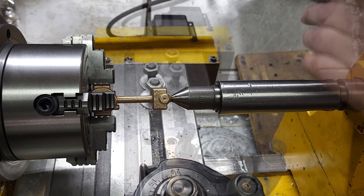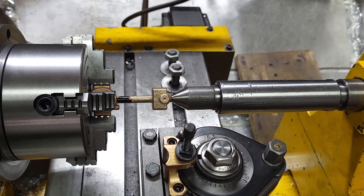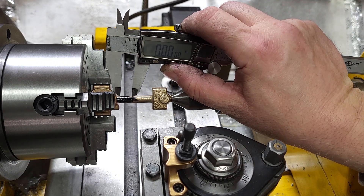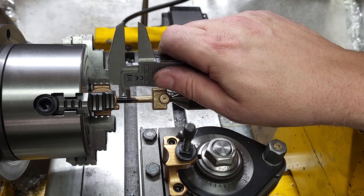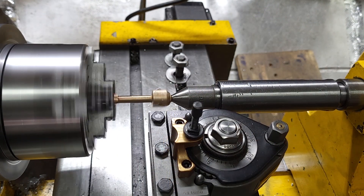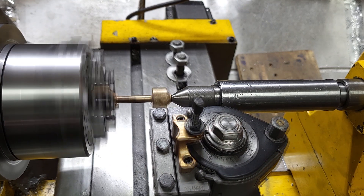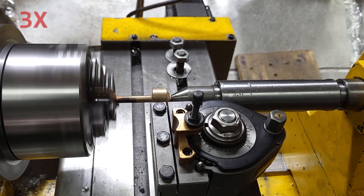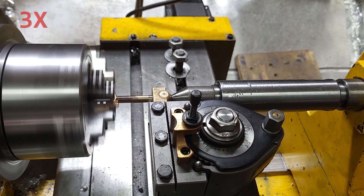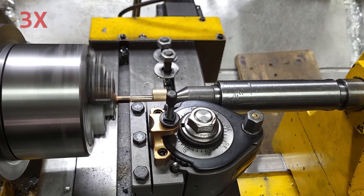A quick mark to mark the length I want to machine — three-eighths of an inch from the eccentric, because the eccentric needs three-eighths of an inch. This is not a critical measurement. I'm using the parting tool here as before; it's really the most rigid tool I have for getting into these tight spaces — sorry about the creaky chair. It works okay for these very light cuts, just taking it down to clean off the casting to get it cylindrical, leaving as much metal as possible.